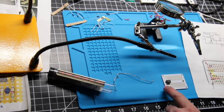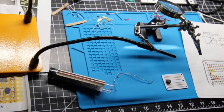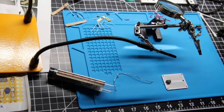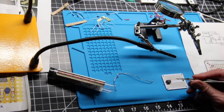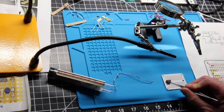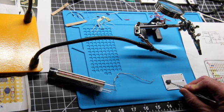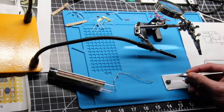We're going to start off with the chip, between the E and F sections, right up at number 1. Remember about the notch. Hopefully you can see, there's a notch right here, which means that our chip's little legs are numbered 1, 2, 3, 4, 5, 6, 7, 8.